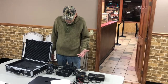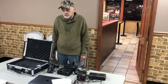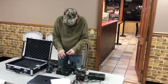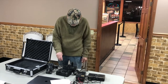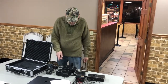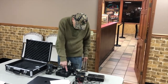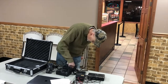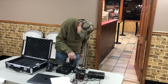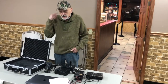The fellow that gave this to me said he made pin contacts with it. When you actually have these hooked together, there is a wire that goes between the transmitter and the receiver — that's just an antenna connection. And if you want to listen to what you're sending, there's a wire that you hook into this one and it hooks back over here. There's a place that says 'ground' here, but over here it says 'monitor,' and you hook into that and you can hear what you're sending through your headphones.